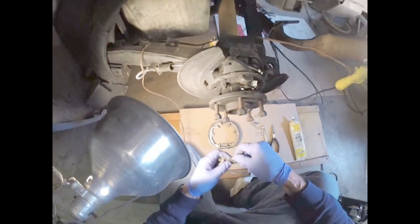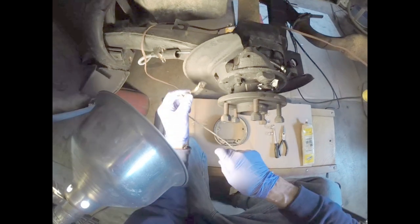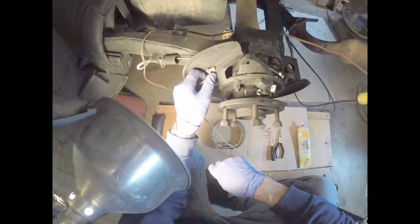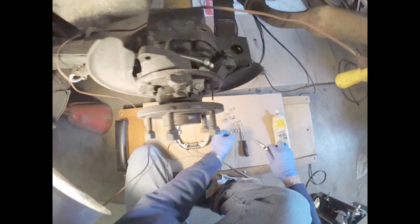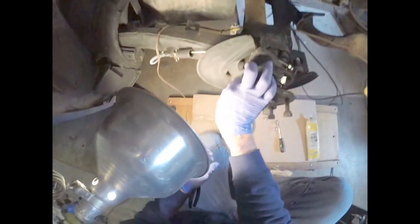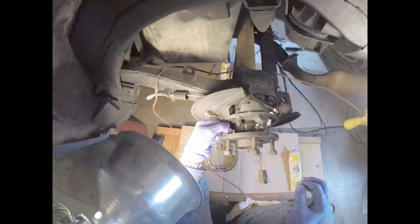Here's what we used the magnet for. The hole that the other pin gets inserted through is right here. If I insert this magnet in the back, you can see where it appears in the back. It will hold the pin firmly while you put the springs on. So let's put that pin in there and put that magnet in there to make that pin firm.